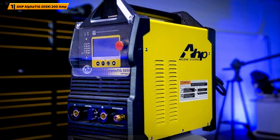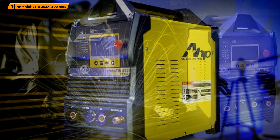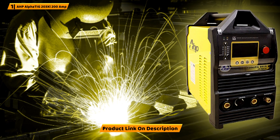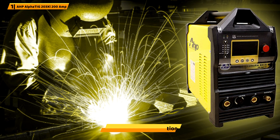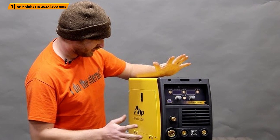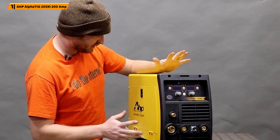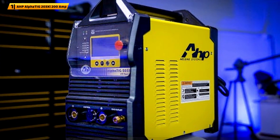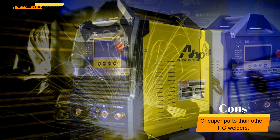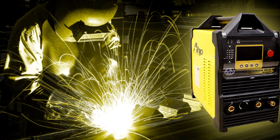Input power: This welding machine comes in 110V and 220V phases. Depending on the material and duty cycle, you can set the gauges accordingly — high-density material and a long duty cycle require high voltage. Duty cycle: The AHP AlphaTig 200DX offers a 60% duty cycle at 200A, reliable for heavy-duty welds. The duty cycle is expected to be higher at lower amperage, giving you high productivity. Weight and size: The welder has a mass of 69 pounds, best suited for stationary use. Its dimensions are 19 by 23 by 12 inches, with the larger size accommodating advanced features.